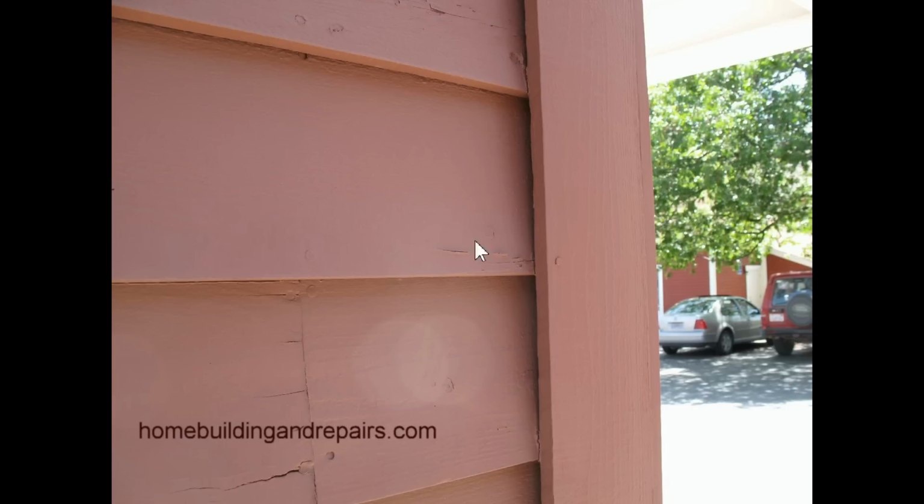If the siding is stained, this would be something I wouldn't recommend filling, because the stain isn't going to match the caulking, unless you have some type of product that will match the stain or you're planning on painting it. And that's just, like I said, because it might not match. I've seen it plenty of times. I actually was just looking at a picture I had where you could tell where they stained the wood and then they filled the gaps with caulking, and it didn't look bad, but you could see where they had done it.